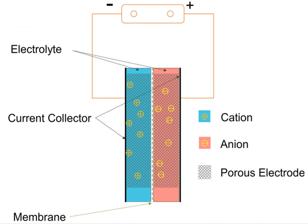Composite electrodes. Composite electrodes for hybrid-type supercapacitors are constructed from carbon-based material with incorporated or deposited pseudocapacitive active materials like metal oxides and conducting polymers. As of 2013, most research for supercapacitors explores composite electrodes. CNTs give a backbone for a homogeneous distribution of metal oxide or electrically conducting polymers (ECPs), producing good pseudocapacitance and good double-layer capacitance. These electrodes achieve higher capacitances than either pure carbon or pure metal oxide or polymer-based electrodes.